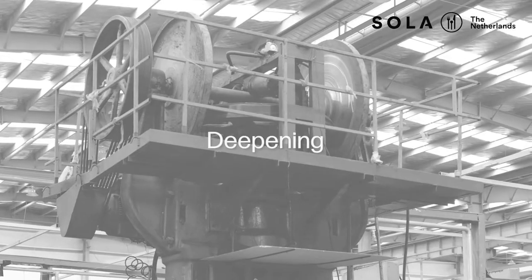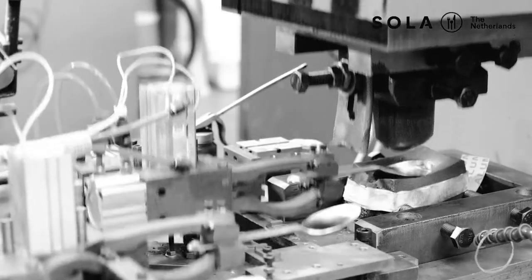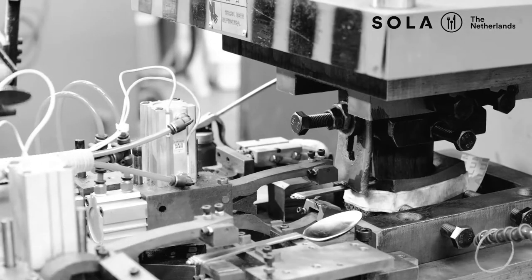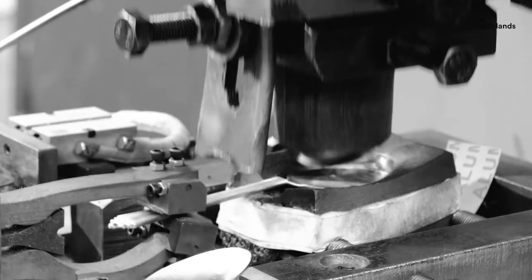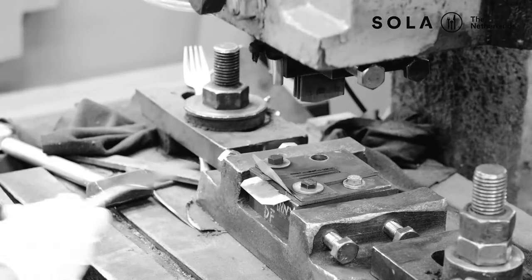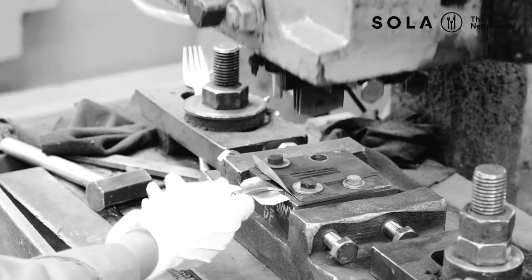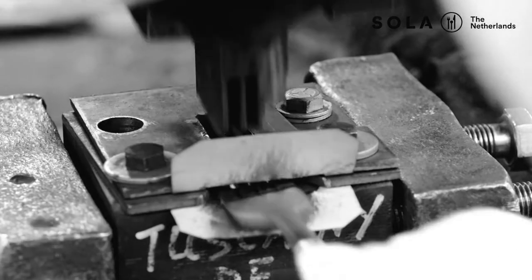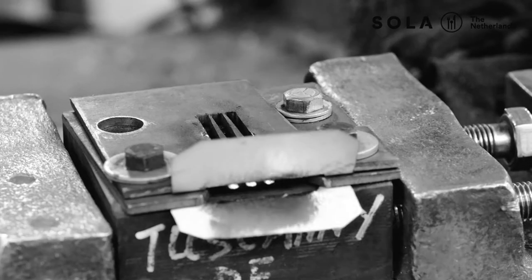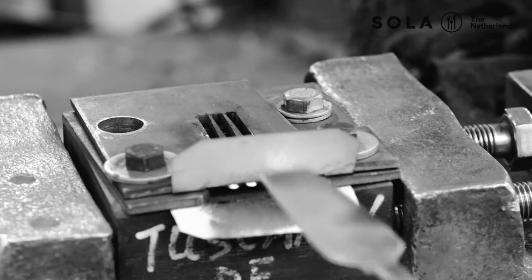The next step is deepening. This is the part where the wide part of the fork and spoons are deepened and/or curved. A deepening mold with the actual shape of the bowl is pressed onto the wide part. The excess material is cut away and the rest is deepened to create a bowl for spoons, or curved for forks. For the fork, there is also a step where the gaps between the tines are cut. The ends of the tines are capped to each other by a bridge in order to avoid the tines bouncing away to all sides due to the mechanical force. Later, this bridge is ground off.